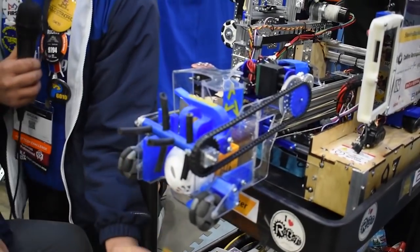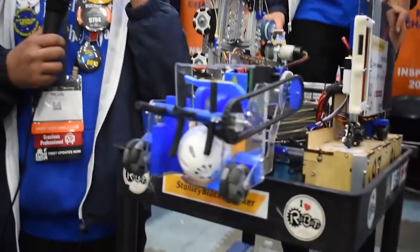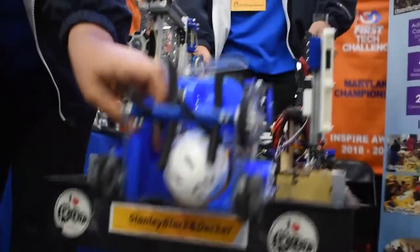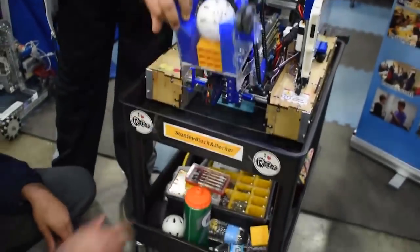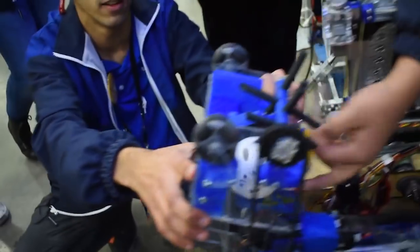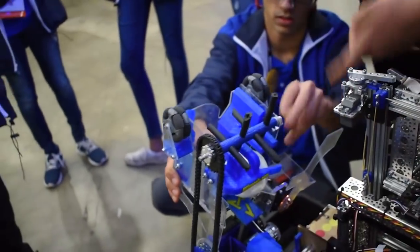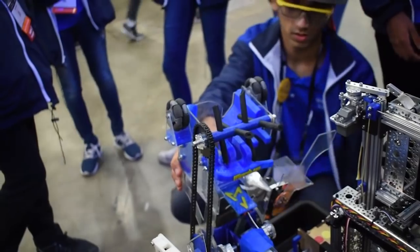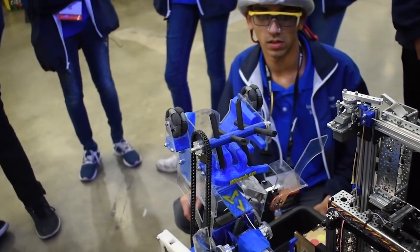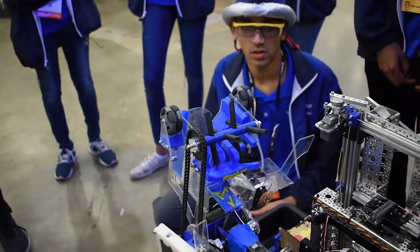If we have a third block it's just going to come and fall because of that cut out in the lexan right there. We were also able to implement sorting into our intake. If we tilt our intake back, we have a flap that opens, and the block slides straight through while the balls ride the flap down to the side. It's actually really consistent sorting just because that flap is there — no matter if the ball is to the left or right, it still goes at the same speed.